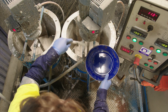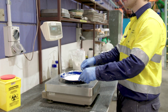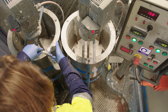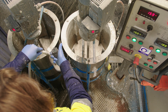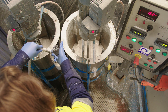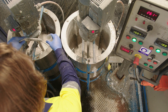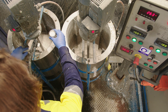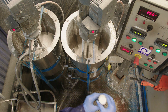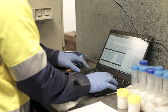When tank B is almost half empty, use a plate to take a sample for the percentage solids measurement. Record the wet and dry mass of the sample. Take a Massey sample for slurry specific gravity and flow rate — it is critical to ensure this sample is emptied back into the correct discharge tank. Take a size sample each for the Malvern and for the Marsh funnel. Once tank B is empty, repeat the same end of pass procedure as you did for the first pass. Record the time, the power draw and the mill discharge temperature at the end of the pass.